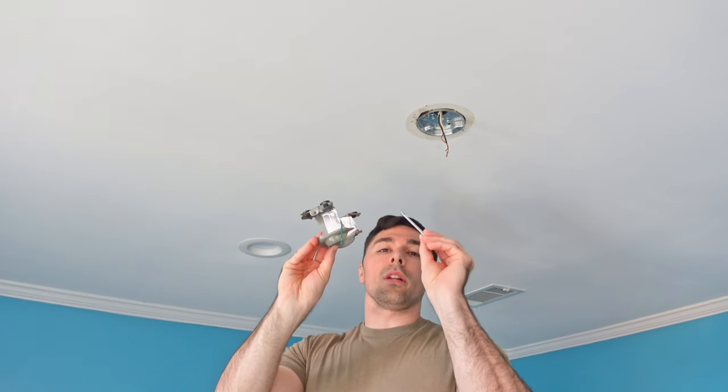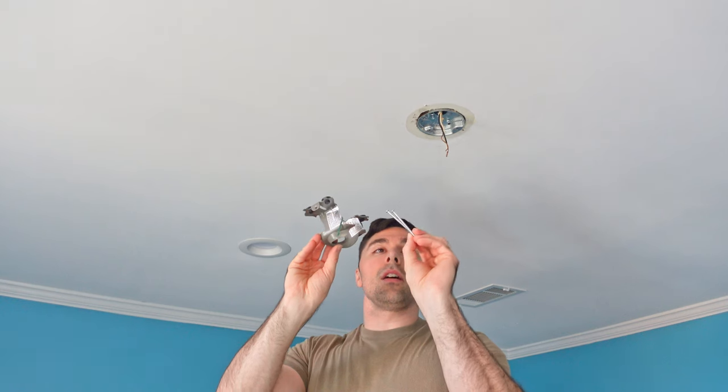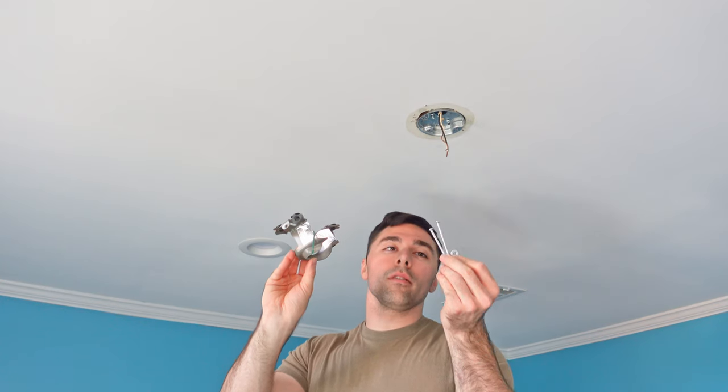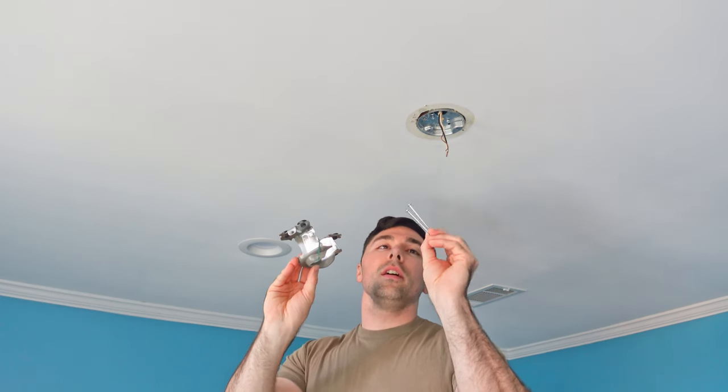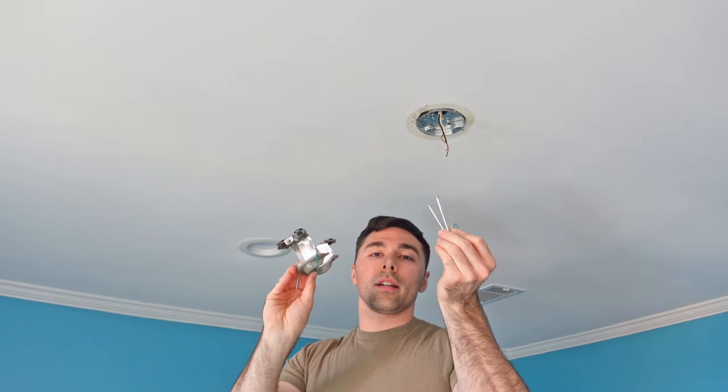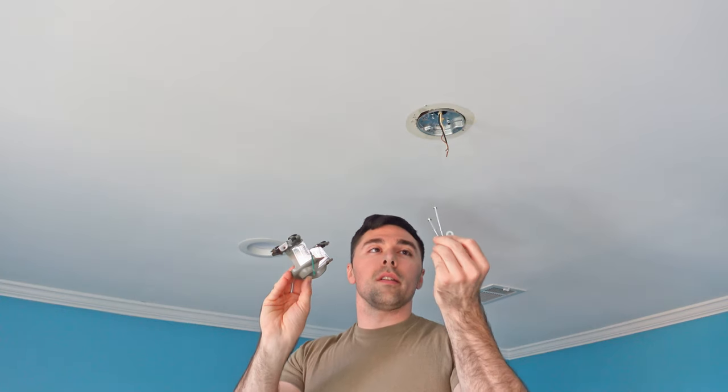To attach the bracket, they want you to use these three-inch long Phillips head screws. I'm going to swap those out and use some two-and-a-half-inch long wood screws, simply because these are so long you can't drill a hole that deep, and the Phillips heads are very prone to stripping. So I'm going to use star head wood screws instead. I am going to use the washers they provide, combining them with my wood screw — since I've got a tapered head it will allow a flatter surface and help hold the bracket better up to the ceiling.